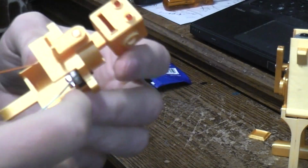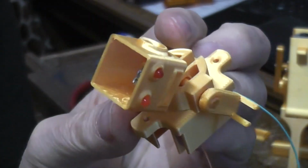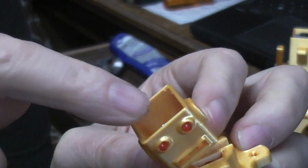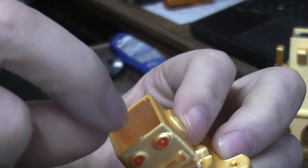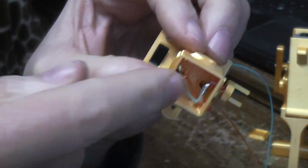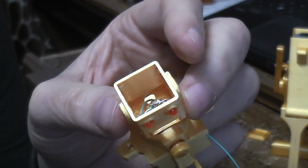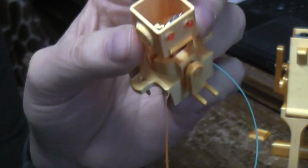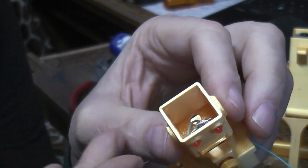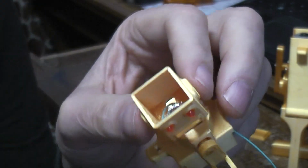The LED eye light thing, that's just an option, and it's just one more thing you have to fuss with. I didn't really cover that because I figured if you know how to wire LEDs, you'll be good to go. But basically the two LEDs, an LED is polarity sensitive. It has a positive and negative. They're both wired in parallel, so the positive of both LEDs is connected together, the negative of both LEDs is connected together. Then off of that I put a single current limiting resistor. In my case I had a 330 ohm resistor laying around, so I stuffed that on there, because a red LED starts lighting up at about 1.8 volts. It depends on the LED, but the point is it's less than 3 volts. So unless you put a current limiting resistor on there, you're going to damage the LEDs. If you wired the two LEDs in series, the actual voltage that they would start lighting is above 3 volts, so they wouldn't light. So that's why you put them in parallel with a current limiting resistor.